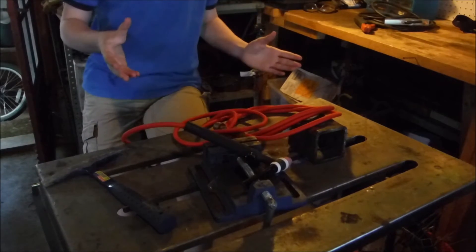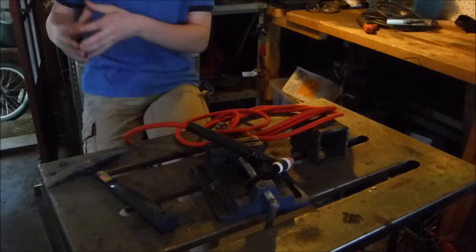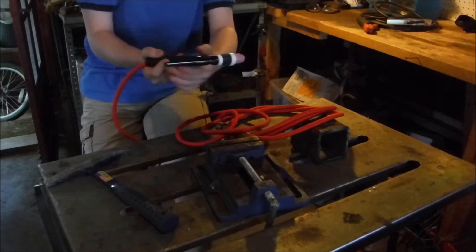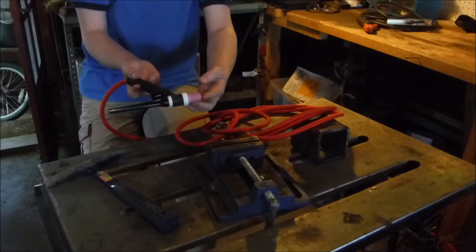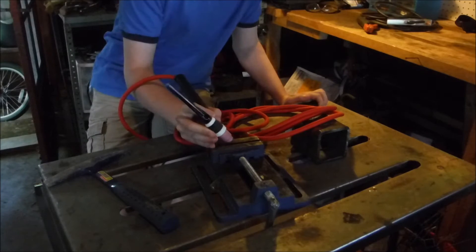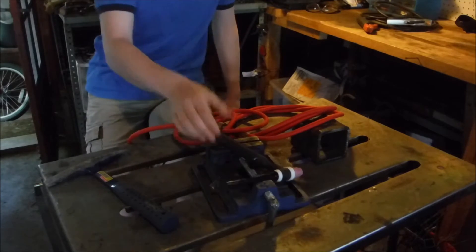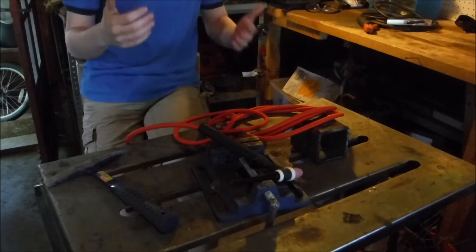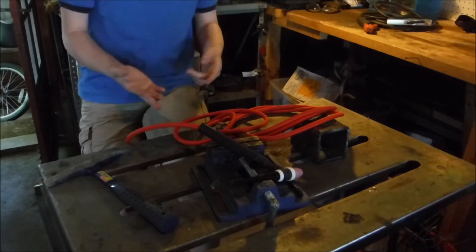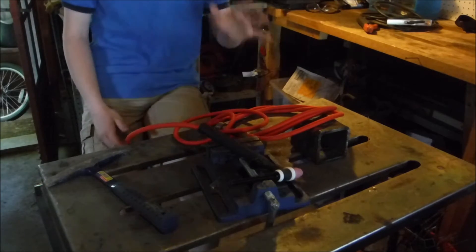Let's talk about what Scratch Start TIG is. Scratch Start TIG is a variation of the TIG welding process. There's a reason it's called Scratch Start — you have to take your TIG torch, and the tungsten is right in here, and you actually have to touch it off on the piece of material. Most people do a scratch, which is why it's called Scratch Start. The TIG process is normally done on TIG machines which have foot pedals and high-frequency start. Scratch Start TIG basically uses the torch and line, but it connects to a stick welder.